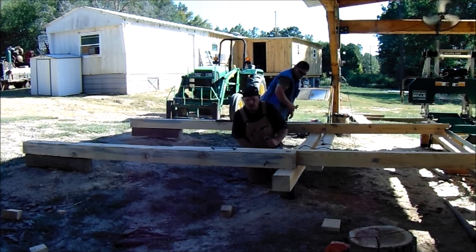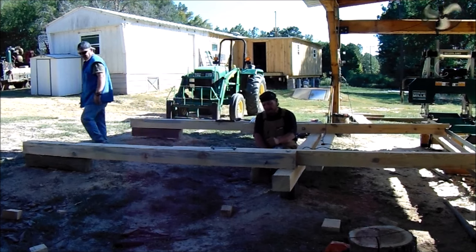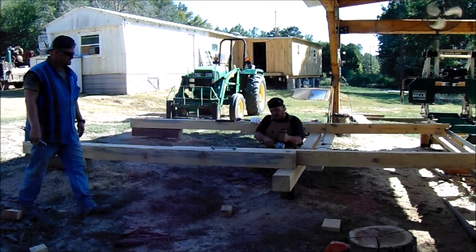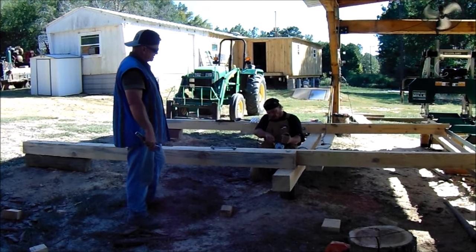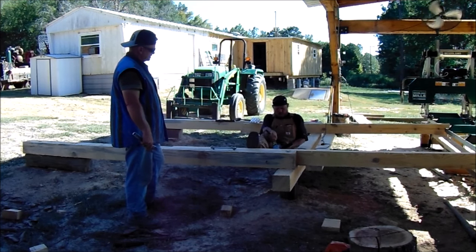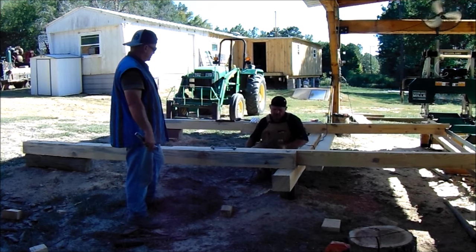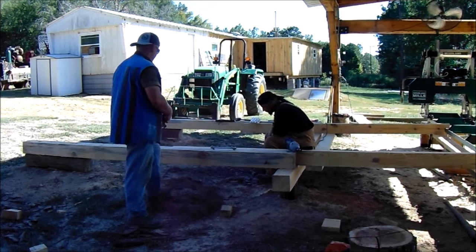And right here, you see, I had one of them days. That auger bit that I'm using right there is one of them cheap Harbor Freight auger bits. And I tell you what, don't waste your money on them. You see how much pressure I'm putting on it, trying to hold it back because it don't clean the hole. And that's a fairly new drill I got there. And look at here, look what happened. I'm going to rip the handle clean off the drill because I'm holding pressure back so tight, trying to keep it to cut.